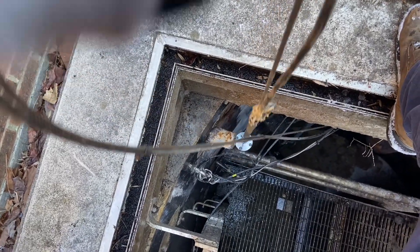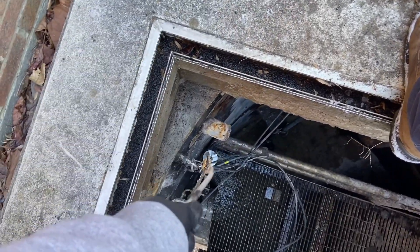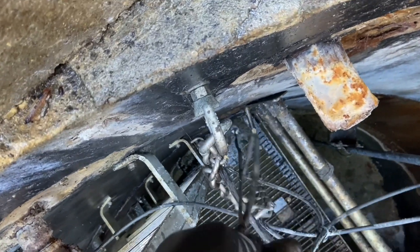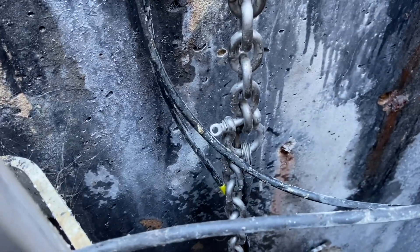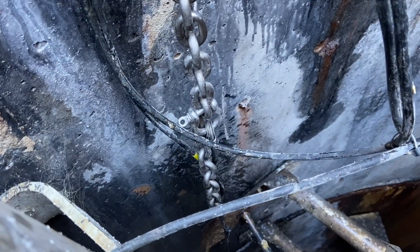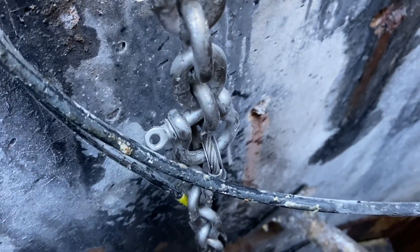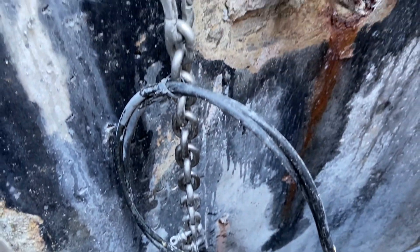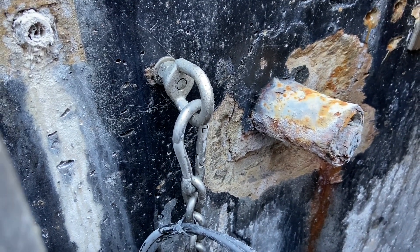Let's get her back in the water. One advantage of using a stainless steel cable attached to the transmitter: because the cable never changes length, even if you replace the transmitter, it still ends up in the same spot in the well — though we can adjust it if we need to. As everyone who works with these things knows, your zero — the spot where it hangs in the well — is the most important thing. If that's off, all your readings will be wrong.